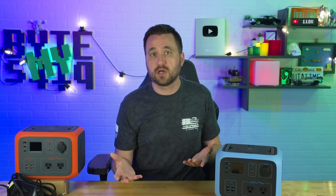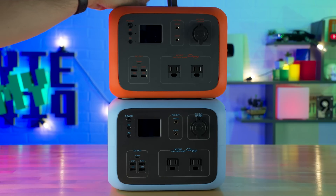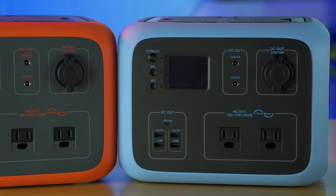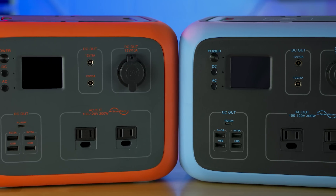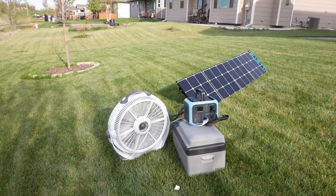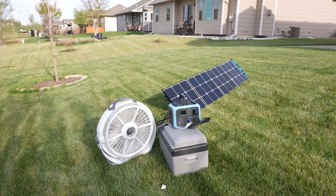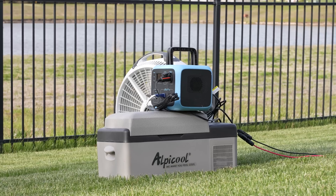Really I'm going to talk about the differences, which comes down to the regulated 12 volt output. With this previous battery, one of the things I mentioned is that it does not have a regulated 12 volt output, which means it would start around 12 or 13 volts. Depending on how far along being drained it was, it would drop that 12 volt output down sometimes a little bit under 10 volts, which normally isn't that big of a deal. But if you are running some certain mini fridges, maybe a CPAP machine, an unregulated DC output could potentially cause you some performance issues.